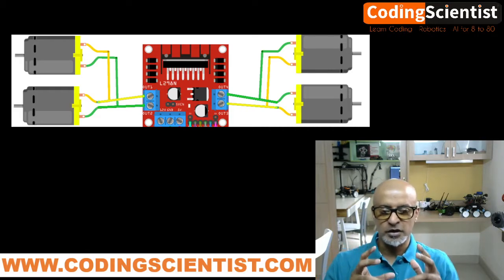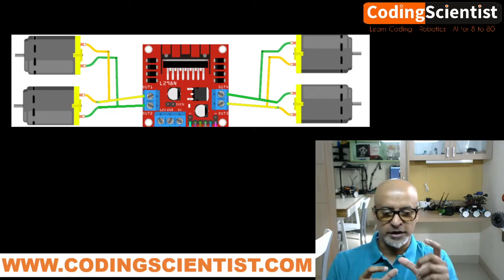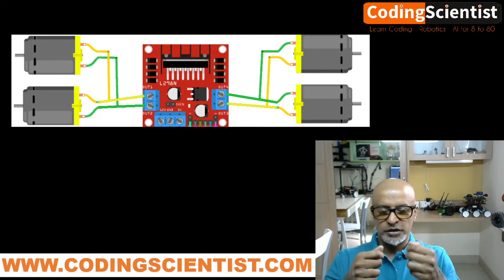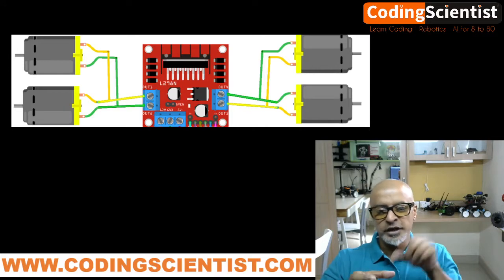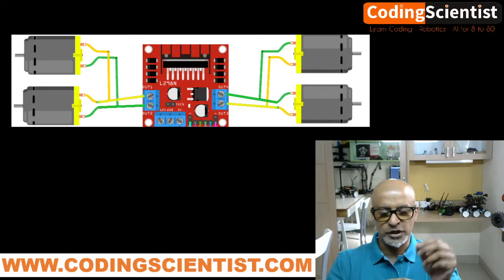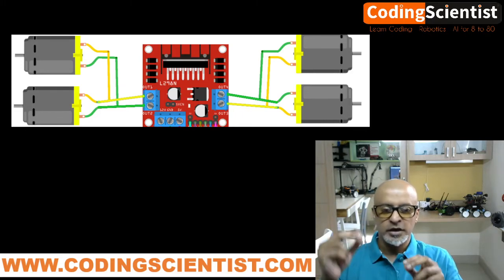So for example, take the motor in your hand and connect it to one single battery. Just touch the positive and negative. If it rotates in the forward direction, the other motor should be rotating in the same forward direction. So you need to touch the polarity and check positive or negative and connect both positive to positive, negative to negative in the same direction.